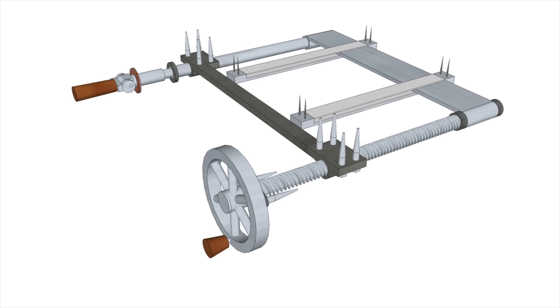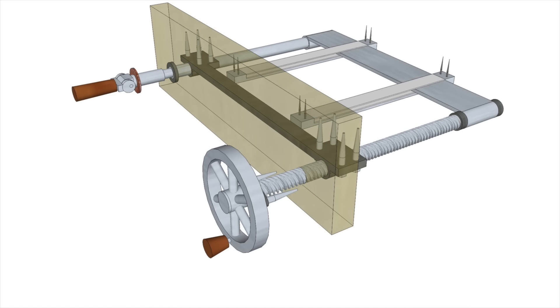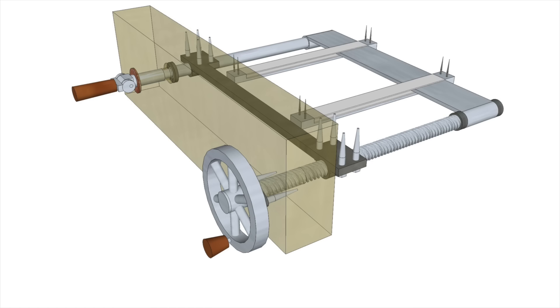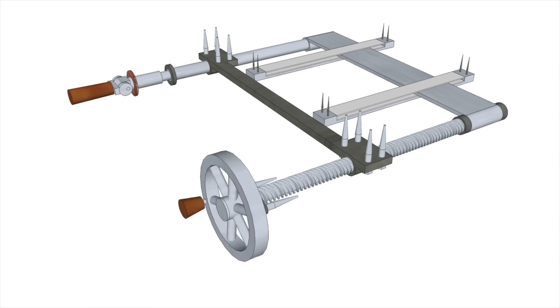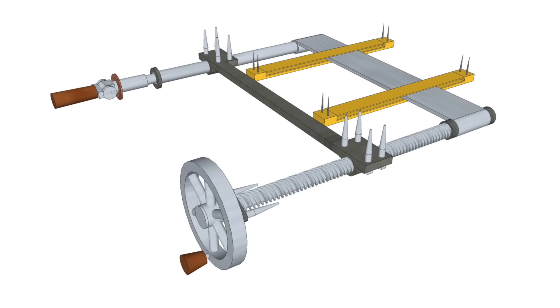The tracks and support for this vise are a bit of a shop project at this moment, but here is what a more polished design might look like — with a bench top, rear jaw, and front jaw — just so you can see the whole thing. The nut and smooth rod sleeve are now connected so that installation is easier, and both are mounted to the bench top and not the back jaw, which ensures a precise mounting distance from the bench top and allows for a simple tracking runner setup.